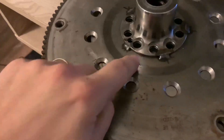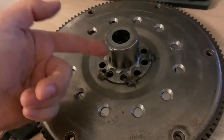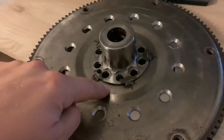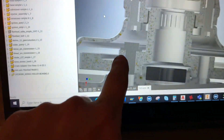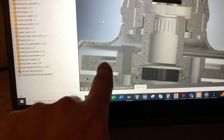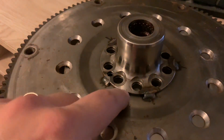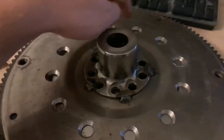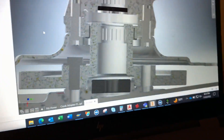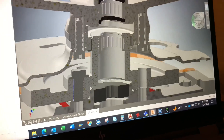What I'm going to do is rework this ring gear — cut these welds, remove this piece I'll call the snout, and then mill the bore to match this bore. So this whole piece will be one piece. It'll basically get pressed into this bore, kind of like it is now, and then you'll still have the bolts on the outside to prevent rotation.